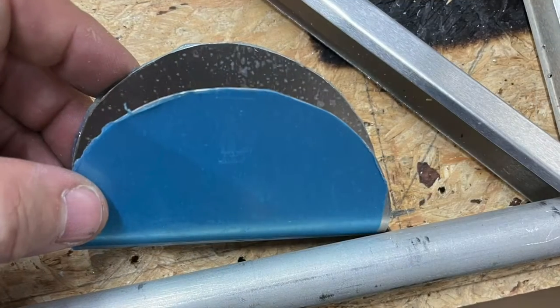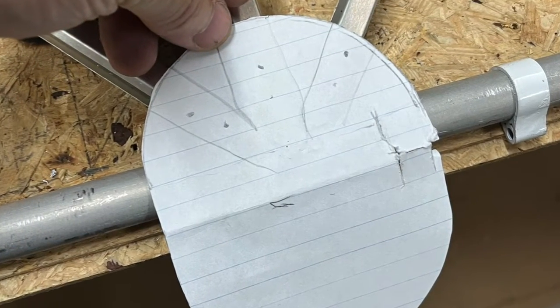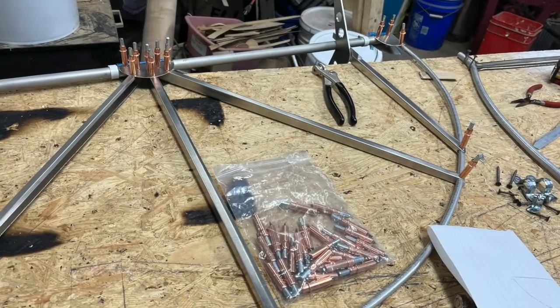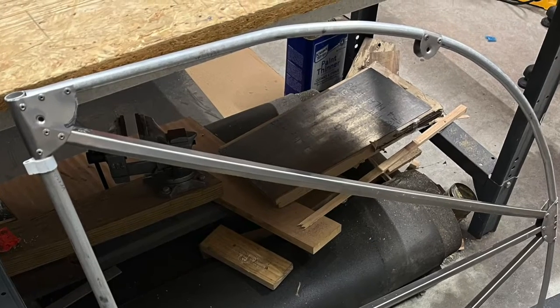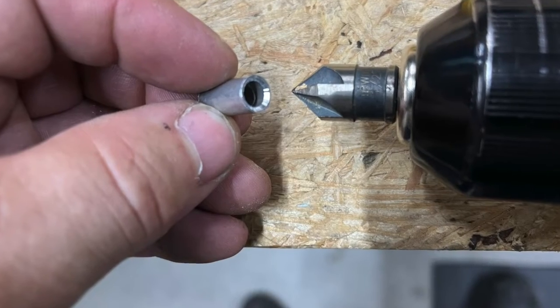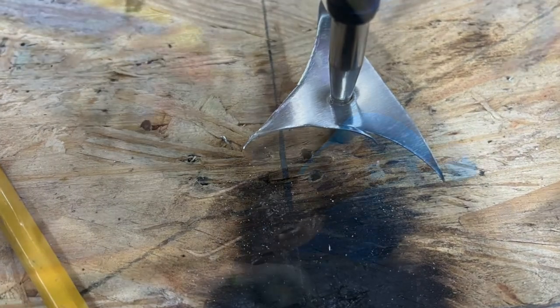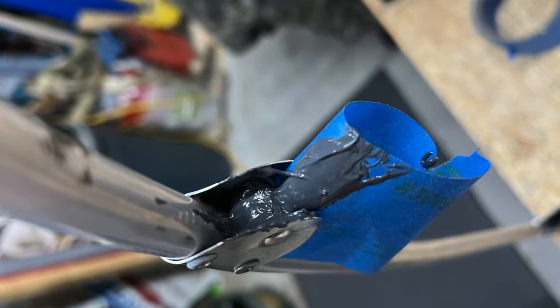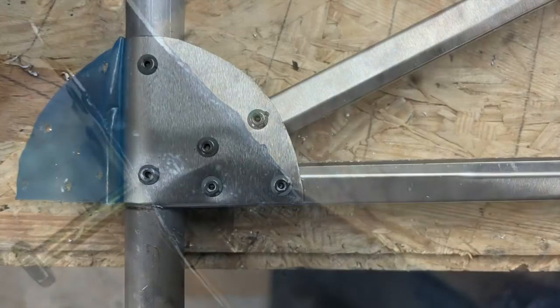Let's make tacos — I mean, gussets. I'd recommend making templates from paper and then tracing them onto the 0.020 aluminum sheet. For the holes for the wire braces, which are basically in the same location as the plans, I took a 5/16 inch with 0.049 thick-walled aluminum tubing and cut the spacers to the proper length. I beveled the spacers inward with a countersink. In the gusset, I drilled an eighth-inch hole and drove a punch to contour the gusset into the beveled spacer. I also used JB Weld to hold them in place. At this point, I'm ready to cover my tail pieces.